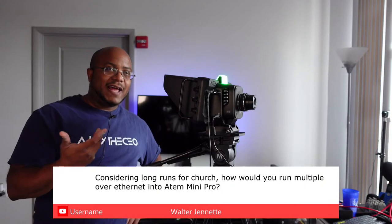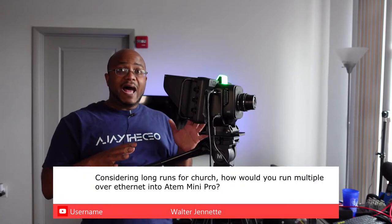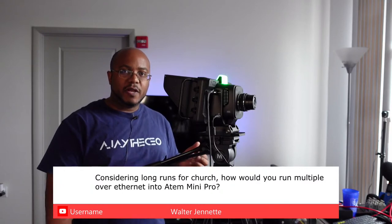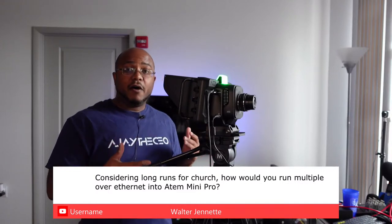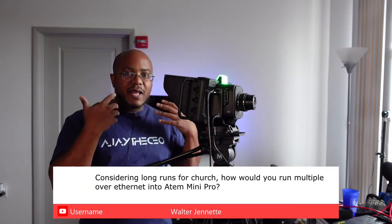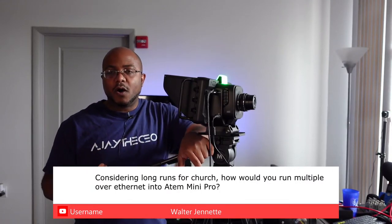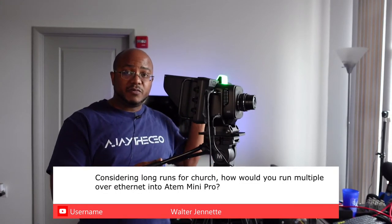I haven't thought about that. If I was to do this type of camera, what I would do is have the moving one be the Pro, so I only have that one copper Cat 6A cable going to that camera that's moving around, and the other ones that are on risers would be just the Plus. Now, the Pro does give you the intercom and headsets for you to be able to talk back and forth. If you want something like that, then yeah, you would go all of them with Pro, but I would just wire those directly SDI up to my switcher and have the only one that's roaming be on that.